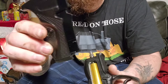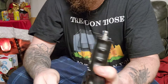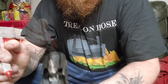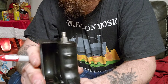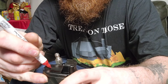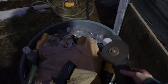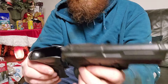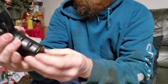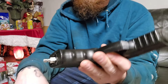For the final step, I want this grip to be able to go back on, but now we've got this adapter sticking out the bottom. So get it lined up like you're going to slide it on, and I'm going to use a marker to mark how wide it is on the bottom. Then I'm going to put this grip right where it's supposed to be and mark across. So now I'm going to cut out that piece of plastic from the bottom and we'll be able to slide this all the way on. I ended up using a cut-off wheel on a grinder and took out that bottom. Now that it's cut out, we'll do the test fit. It's not beautiful on the bottom anymore, but that's perfectly fine. The magazine still comes in and out, it feels better in the hand, and it functions on the HPA — and that's what matters.